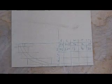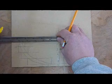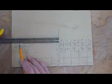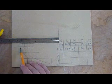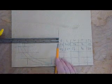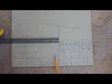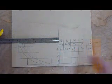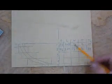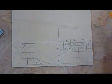So the first thing we're going to do, and of course you can use whatever ruler you want, but I'm going to use my combination square here. What you want to do is go from your center line and measure out. You do not measure to the curve of the bowl, you measure to the outside block. In this case it's about 5 1/16. So of course times 2, that's going to give us a 10 1/8 inch diameter. What I've done here is divided this up with the same amount of layers, and I just number each layer 1, 2, 3, 4, and 5.